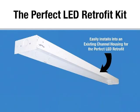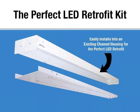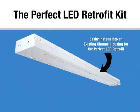This product can be installed as a new fixture but is primarily intended for retrofitting. You would take a strip channel, just like we would do with a fluorescent kit, and take all of the internal electronics out of it, bringing it down to where the power is coming into the fixture. The retrofit channel is set up to install over the top of the existing channel and then attached to the side using zip screws. Your existing strip acts as a wire way and electrical connections can be made inside. This is what allows it to be installed as a retrofit over the existing channel, but because of our ballast box, it allows us to submit it as a new fixture.